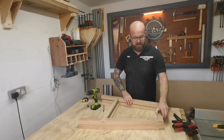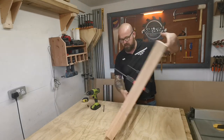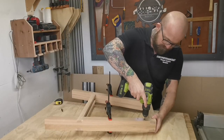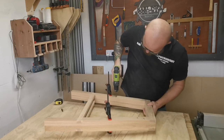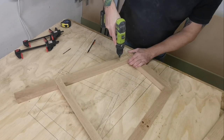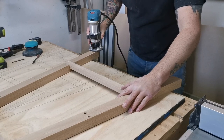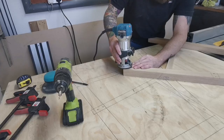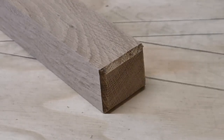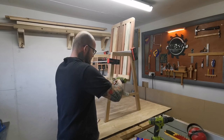Because these leg frames are symmetrical, we can clamp them together and drill through the same holes — this gives us perfect alignment when we put the chair together. Next I add a small chamfer of 45 degrees on the base of the frame, which prevents any splitting or shattering of the feet when they're dragged around on the floor. To secure the seat to the legs I pilot hole first and then screw them into position — I can then later fill these screw holes with plugs.